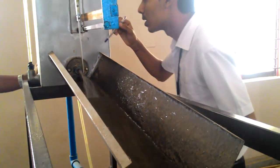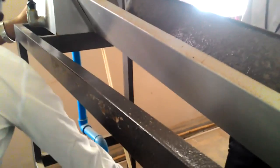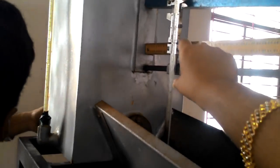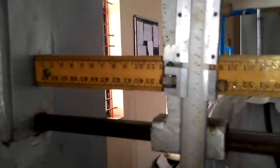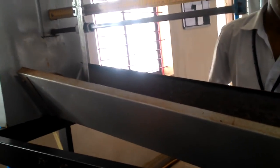After that, release the water. From the orifice hole, the water passes as a sheet of water. Here you can see the vernier calipers — the tip of the vernier calipers you have to adjust in the upward or downward direction as well as forward and backward direction. Take the x1 value from the main scale and the y1 value from the vernier scale.